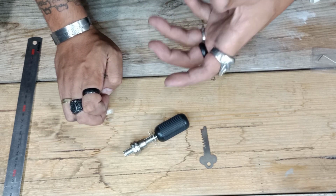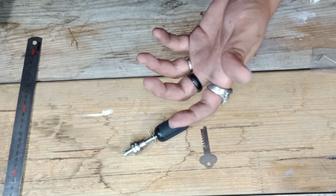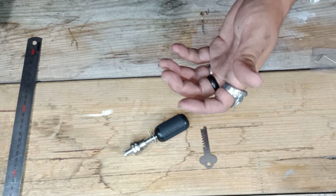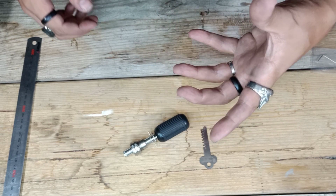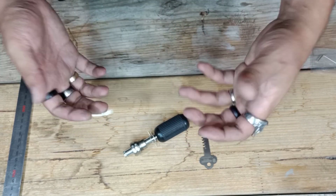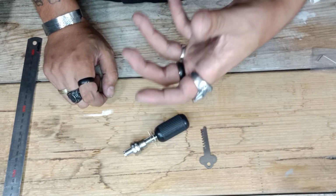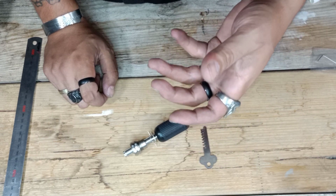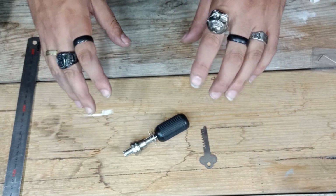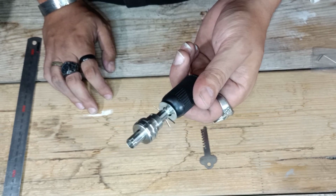They are used still on some vending machines, Coke vending machines, washing machines still use some of them, but they're usually the giraffe keys. Some Harley Davidsons actually use tubular keys for their locks, but you know, they're not quite as common, but you can still come across them. And the steering wheel locks is a good one, or hitch pins, motorbike disc locks and stuff like that, all usually utilize a tubular key. And it may seem like a weird alien technology, but they are so easy to impression that it's not funny.